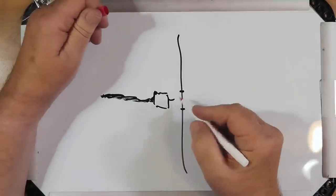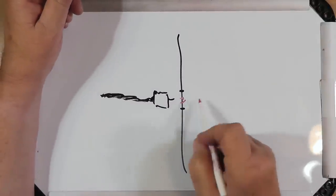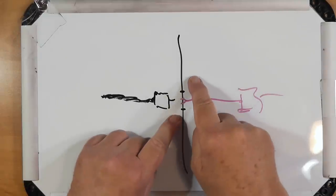Now, if you're just using the cable by itself, you can put a smaller hole in the wall and then pull the cable in, put the connector on the end of it, and you have a smaller hole. Now, what is the problem with making these holes larger? Well, you need to fill them in. A mouse can get through an area the size of a dime, a lousy little old dime. And you figure that the coax connectors are bigger than that. If you make that hole bigger, you're going to have to seal it somehow, okay?